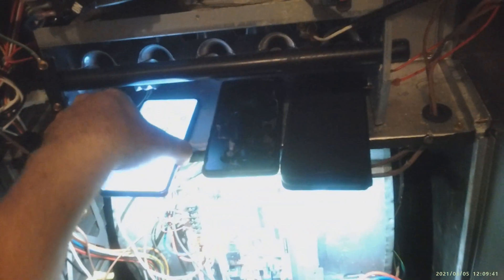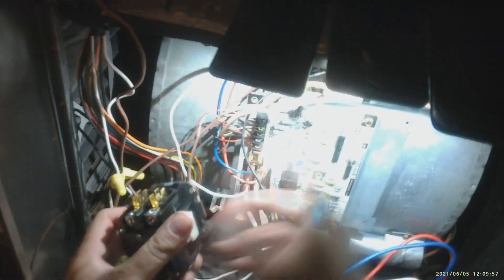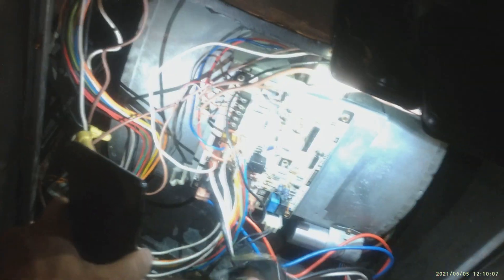When you have a circuit board like this that's going bad and you want to bypass it, the first thing you want to do is turn off the power. This is where your main power is — we're gonna have to tap into the main power. You need a contactor to bypass this board because this is your fan, and this is your fan relay right over here. We need a relay, so we're gonna put this here to substitute this relay, which is hooked up right over here.